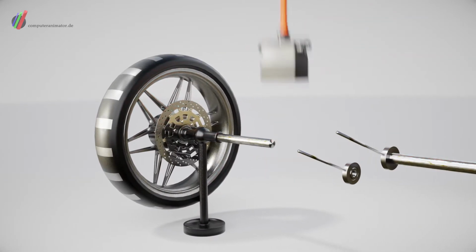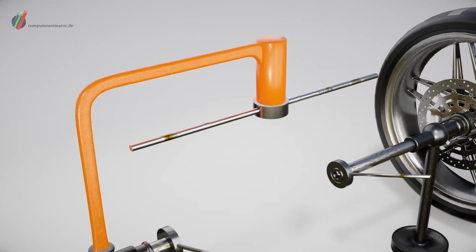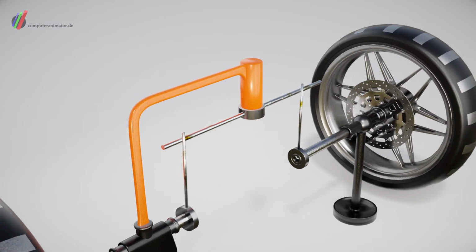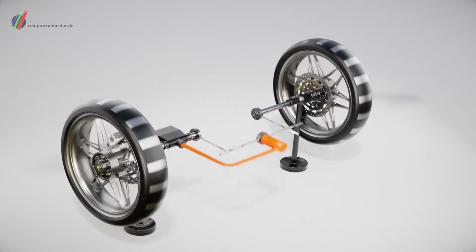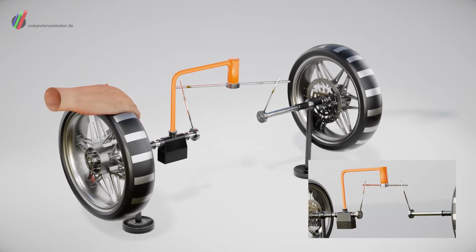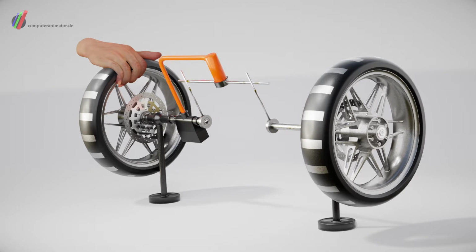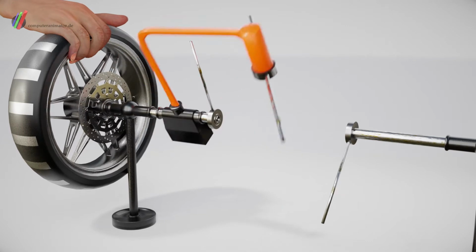Let's put this bar on a pivot, so that it can swing in either direction. Now, the bar can still turn both wheels at the same speed. And because it pivots, it lets one wheel turn even when the other is stopped. But if turned too far, the bar will swing around until it won't drive the spokes that turn either wheel.